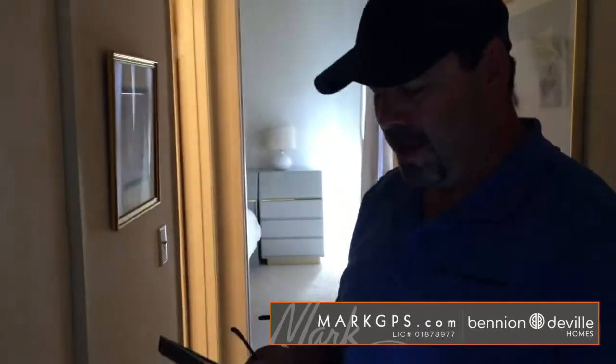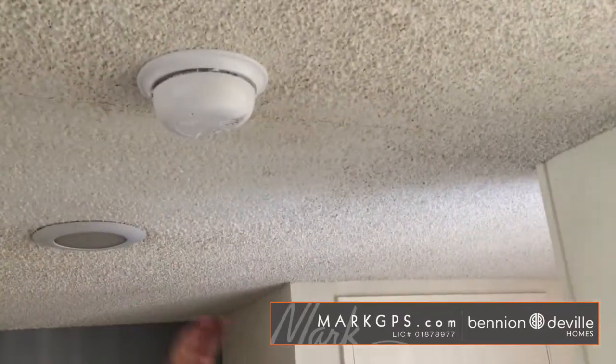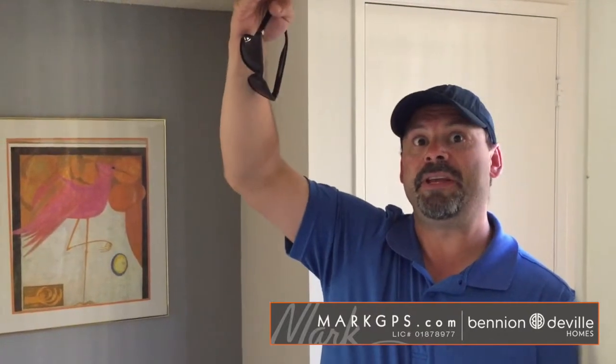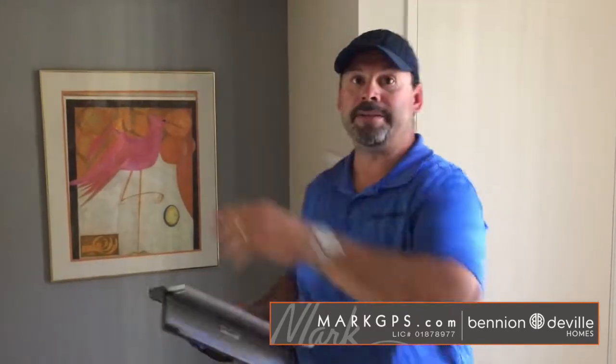Get that cleaned up. Interior living areas here. Just noted that right above Mark's head there's some cracking. It's cosmetic in nature. It looks like it's been patched. This is right below where the air conditioner sits up on the roof. My guess is that the old one might have had some condensation leaking or some bad coils that caused it to saturate, and that's what came into here. That could have been the reason why they bought a new one. The roof looks good there, and there's a new unit there. The roof looks good, except for a couple of tiles, but that's over the pitched area.